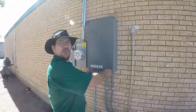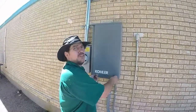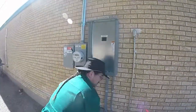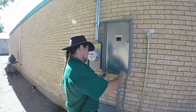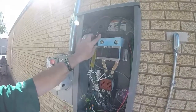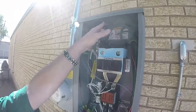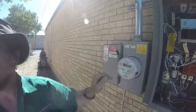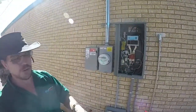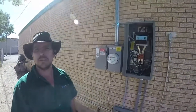Let me open this up and show where we tapped — because if I do that, they have no excuse to ask me to drive all the way out here to do this again. So this is where the main grid is coming in to the transfer switch. We did a Polaris lug, which is a code-compliant tap, and then tapped over to these conductors. In less than eight feet, we hit our service disconnect and our breaker. This is the code-compliant way to tap solar when you also have a generator — making sure that the generator and the solar are isolated, and that you have your code-compliant disconnect switch. Life is good.